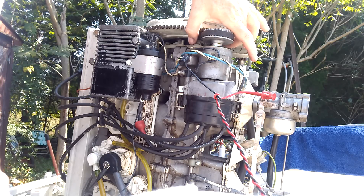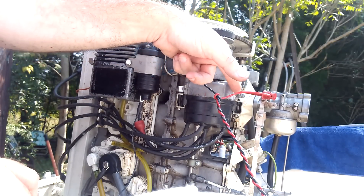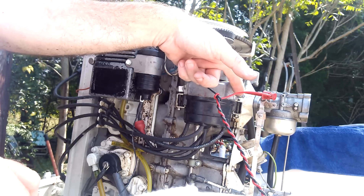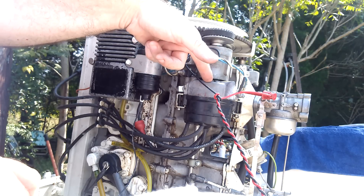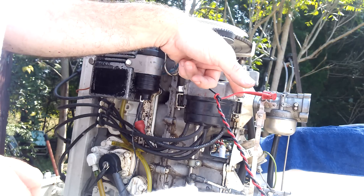Make sure your belt tension is right — you can use the back and forth trick to find your zero. You're looking for this point on the distributor where the optical coupler comes out to go from zero to — in this case this one only goes to four. These things actually have a light bulb in them, and I'm thinking the bulb in this one has gotten really dim. But the boxes will usually switch as long as it goes from zero to a couple of three volts.